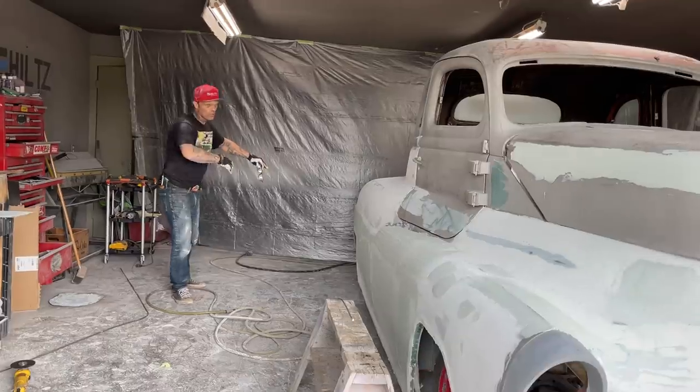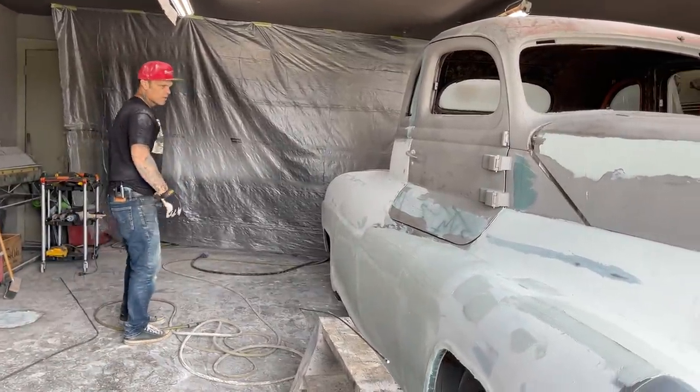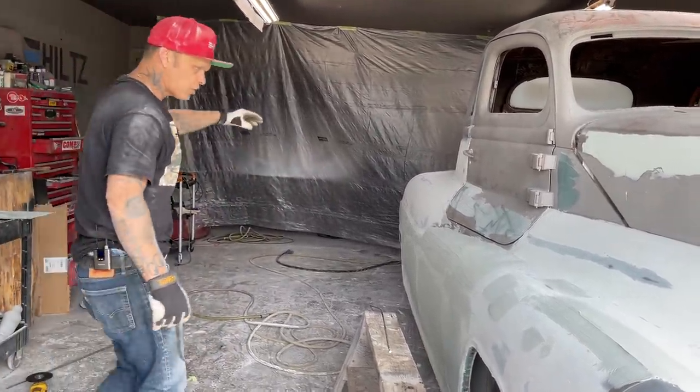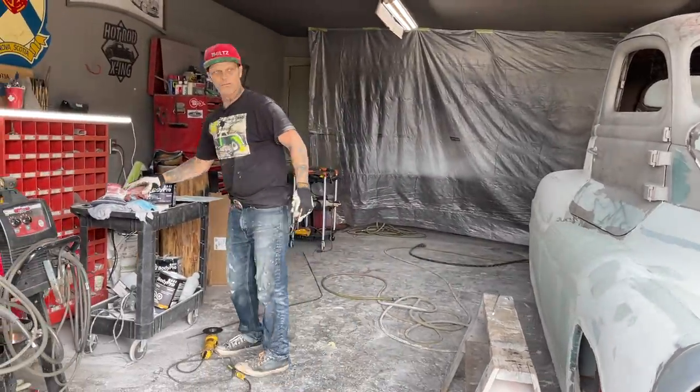I've been sanding this side. I've gone through the whole side. I've had some low spots. I've been hitting metal. I've been hitting fiberglass. What I've done is went over and skimmed it again so I can try to get that floor to one level. It's a big job sanding that. Yes, it is, but I've been busting it off with the DA and it's been going fairly well.